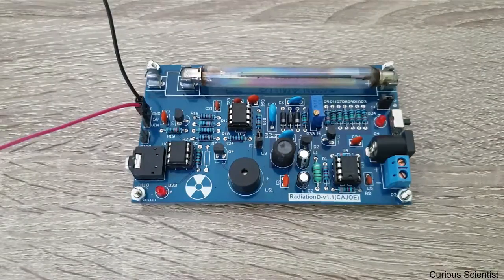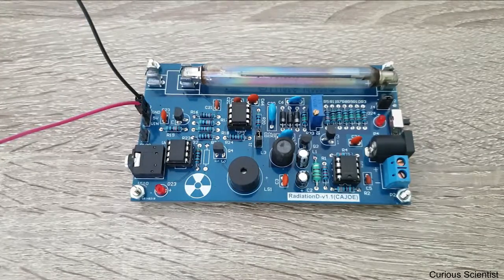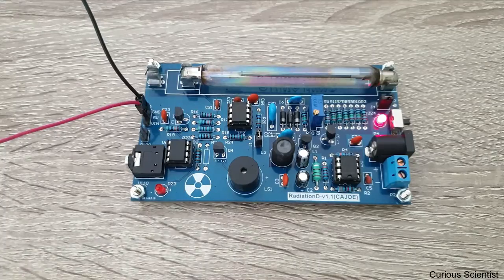So now I have the two wires connected to a power supply at 5 volts. Let's turn it on. You can see this power LED, and here you'll see the other LED blinking. I guess you can hear the sound. It has very low power consumption — according to the power supply it only draws 0.015 amperes, so basically you can run this circuit from batteries for quite a long time.